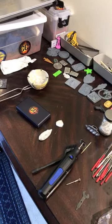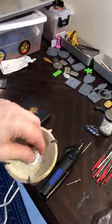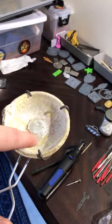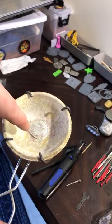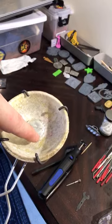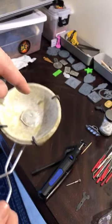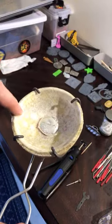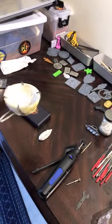It takes a little while. Sometimes you're sitting there like, come on, and then it'll get melted on one side. A lot of times what happens is, say this is shot, right? You'll be melting it. I have one torch that stays on it and then another torch that I go back and forth with. I'll start here and then go over here and come back, trying to keep it even, go to the back of it, because if you start over here, it'll melt it down. The whole thing will look like it's melted, but it's not underneath. So you've got to start whipping it around a little bit and heating everything up, making sure this stays nice and hot right here when you pour it, and I keep a torch on it the whole time. So I'll do something that way, and you guys can learn a little bit from that.